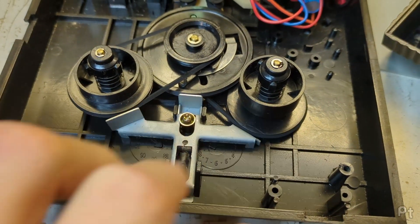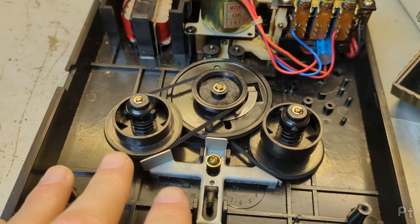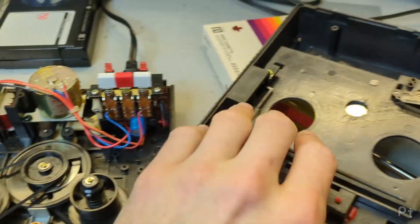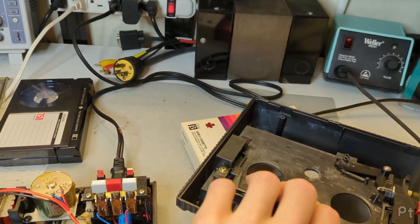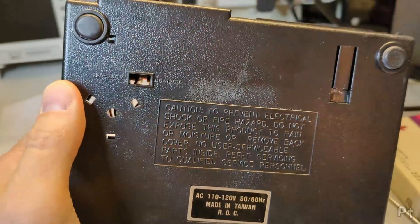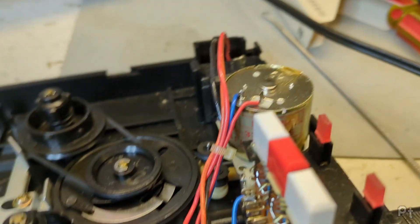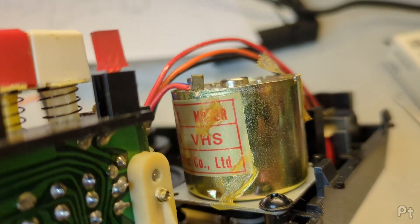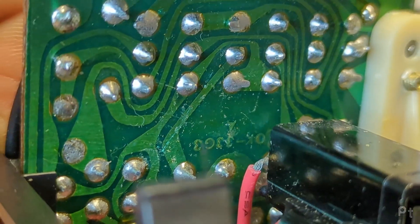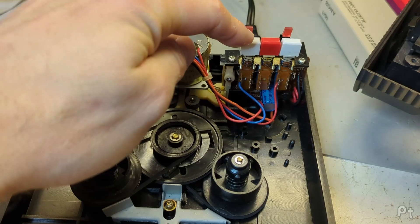Against the two reel tables - kind of cool. Side note: this was manufactured September 1988, which feels late for beta. The VHS name on this motor tells me that a lot of this was probably originally designed for VHS and then adapted for beta - though making all this custom molded plastic for beta is a lot of work and tooling costs. The OK33 branding is all over the inside - on the motor it says OK33 from JNF Electric, which I guess is Johnson and F Electric Limited.